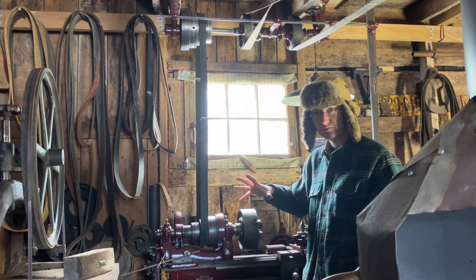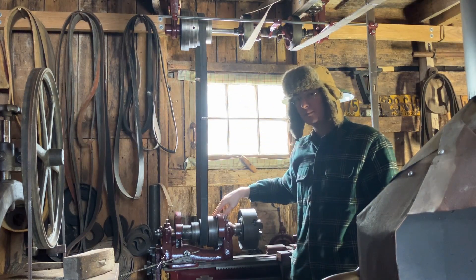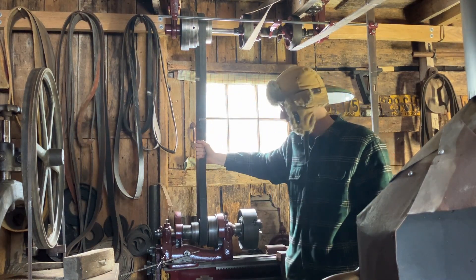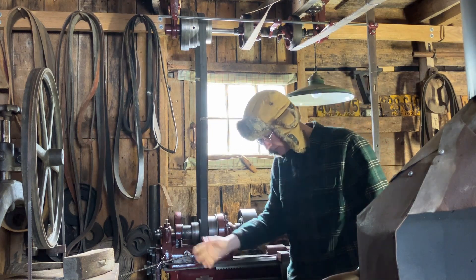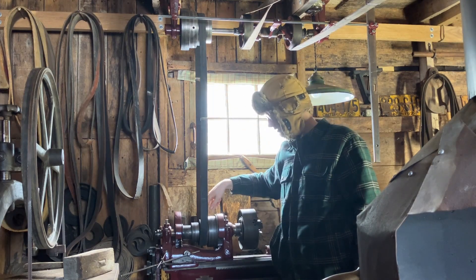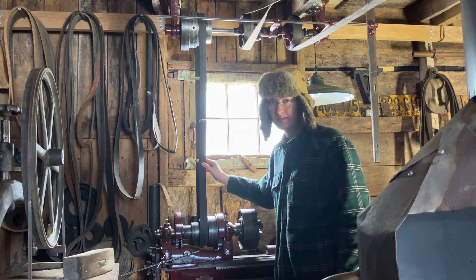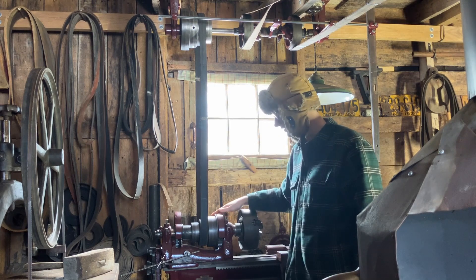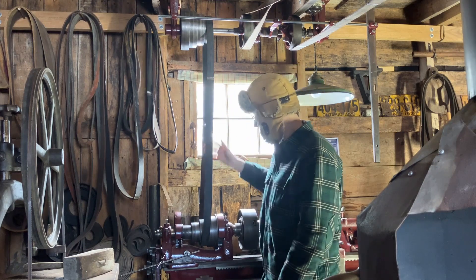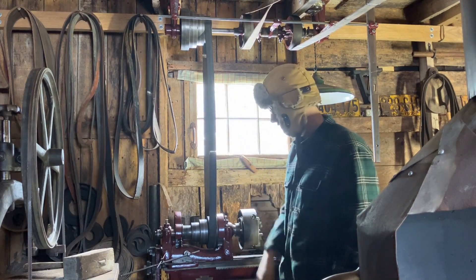Other than the step ratios and width, they can be different sizes — this is a great example. This pulley is reasonably bigger than this one, but the ratio between the step sizes is the same to allow for the same length of belt. You have four different steps that will always give the same tension on the belt, because you don't want to adjust belt tension just to get a different speed. All you do to change it is shift over onto the smaller pulley on top and then down onto the larger pulley on the bottom. There are different ways to do this to keep your fingers out of harm's way.